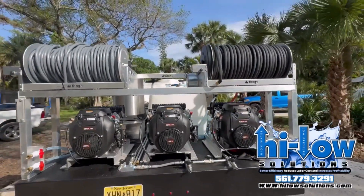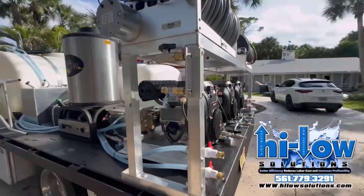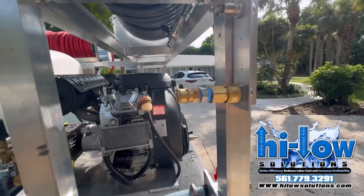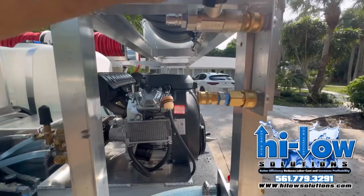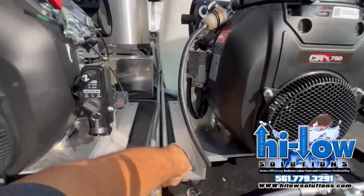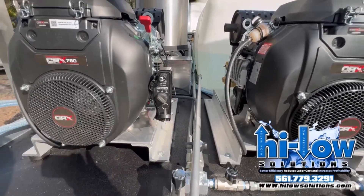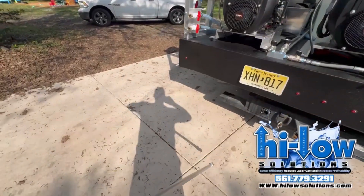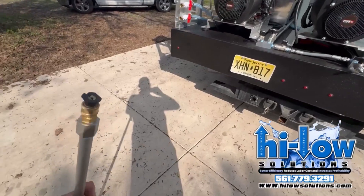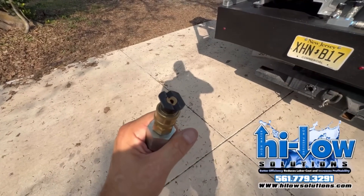Something real simple to do, but it makes it so much stronger. We've also got these little holders for his ball valves and his fire hydrant fittings. And he's got some custom wands — really all we use is a half-inch wand with a ball valve, and it's just so much easier. Because of the higher water volume, we use a chemical tip — that's what we use for 21 gallons a minute or 30 gallons a minute.